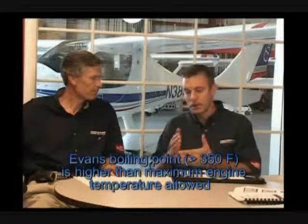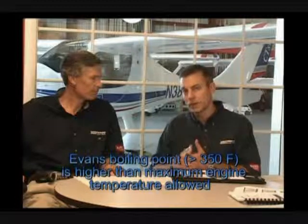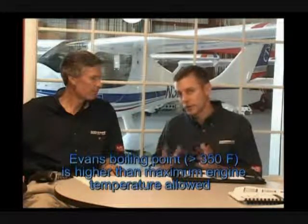Some of the advantages to Evans are that the boiling temperature, for instance, is very, very high. It's in excess of 350 degrees Fahrenheit. And since your temperature limits on the 80 horse is 300 degrees Fahrenheit and the 100 horse is at 275 degrees Fahrenheit, you're never going to see the boiling temperature of the Evans coolant.